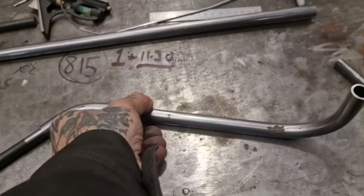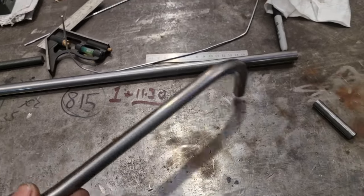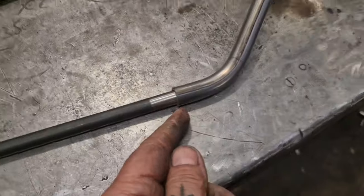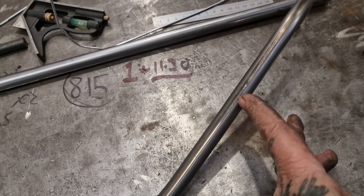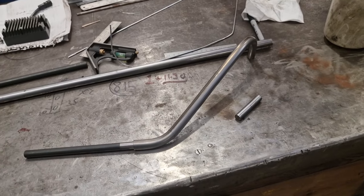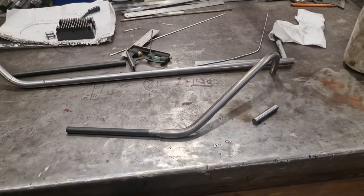Okay, so this one's about there. It does need a tweak and I might need to cut a little piece out of here and make a join. But apart from that, we're pretty much sitting how we're going to sit. So what I'm going to do is get a tack on there on this end, then cut it, take a little piece out, put a slug in and weld it one end - then we'll see what's what. I'll weld that in there first and see if I can manipulate it without a weld, because that would be preferred.